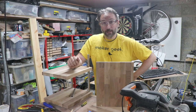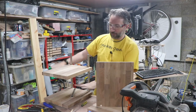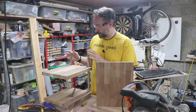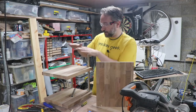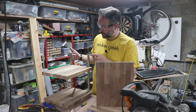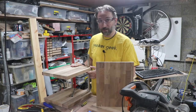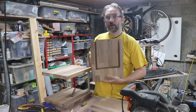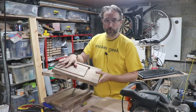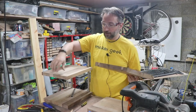So that brings us to this, which are bedside tables or bedside floating shelves. My plan for this, as you can see, this one is nearly finished. It's going to have another section, a smaller shelf here. This is stainless steel and just pretty simple walnut blocks. The important part is that I have been CNCing a recess underneath for the stainless steel to go in, so that it has this natural floating look without you being able to see the metal as such.